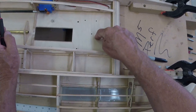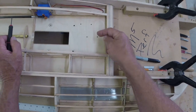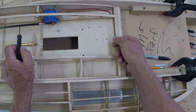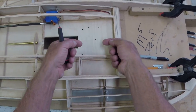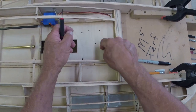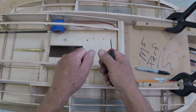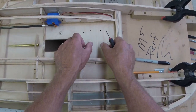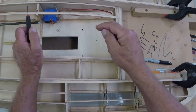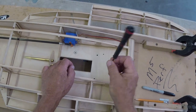But what I was getting at is someone complained about the way I mount these, that I mount them solid. He said, oh, that's gonna blow up that servo, the gears, because of the input that it's gonna get. I also have a nearly solid shaft that connects the servo to the carburetor, with just a small bit of flex in the middle of it and then two clips. And he said, oh, that's gonna ruin your servo, all the strain on the gears. No, that throttle moves really easily. Tell me where the strain is coming from.